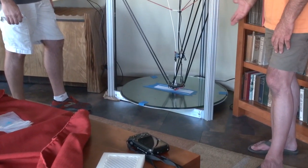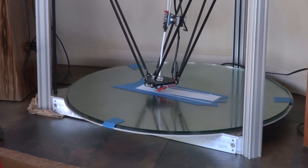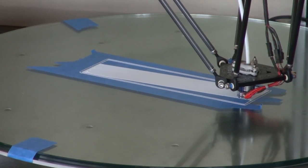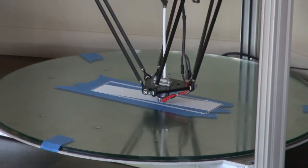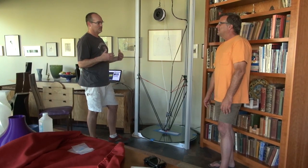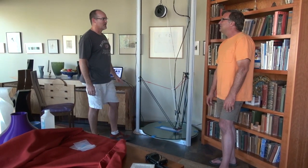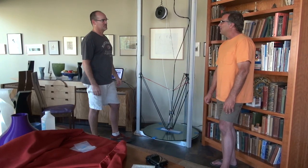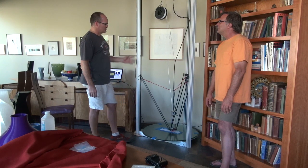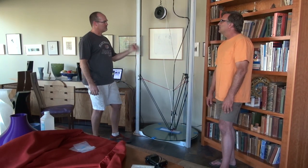Because it's just the first run, this one's running really slow — just to wear it in and check it out, rather than blasting through and breaking something. Let's start slow and speed it up as we go. What's the fastest we could print reliably? You're going to be able to do travel moves at about 500 millimeters per second, which is super fast — don't get your hands in there when it's moving. The actual printing speed will be about 100 millimeters per second, which is very close to some of the fastest small 3D printers you could find. The limitation right now is we just can't push the filament through the little nozzle faster — there's not enough grip. Once we resolve that, we'll be able to get speeds even higher.